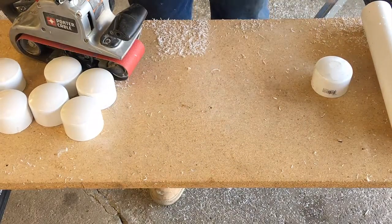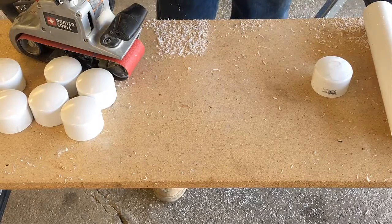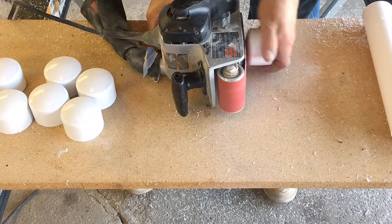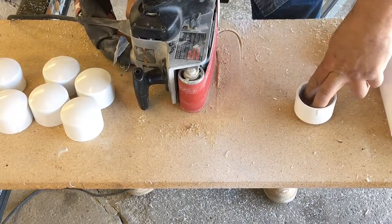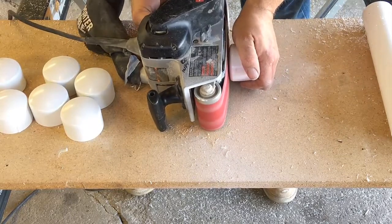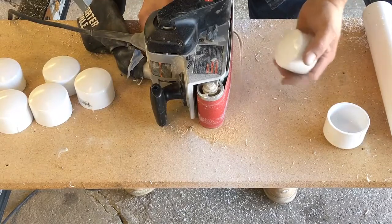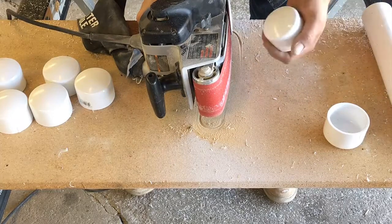I'm going to use the belt sander. I'd like to say you don't need any tools for this but you're going to need something to cut your PVC and something to cut the tabletop with. The rest you can sand by hand. I'm going to sand these flat — I don't want to get too carried away and poke a hole in them. You don't have to take all the bow out, you just want them to sit flat when you screw them in. You want some material for the screws to hold onto — if it's too thin it'll break through. I've got eight of these to do for this table, so I'll fast forward and when we come back we'll cut the table tops.